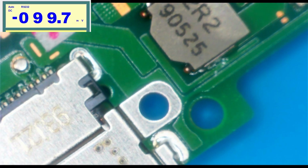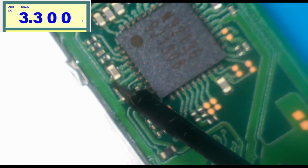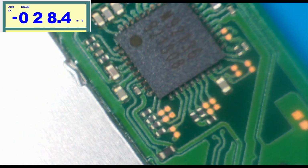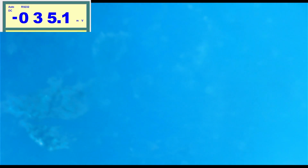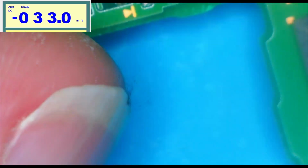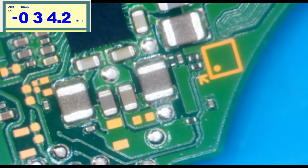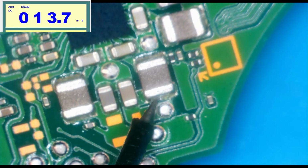And we know we're getting voltage at our M92 because that 3.3 is also felt right here, and I think this is what, 1.8? Yeah, that's 1.8 there. So our M92 is not shorted. So we got voltage coming in. We have voltage coming into our Max IC. And no voltage. We're missing our, I can't remember what it's supposed to be at that inductor. I cannot remember. Right here.